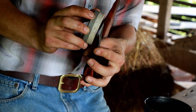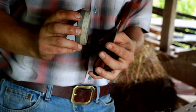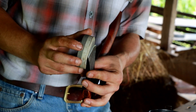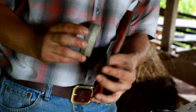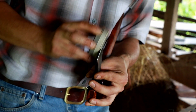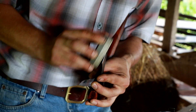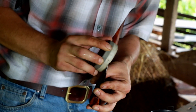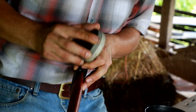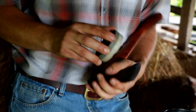What I try to do is stay with the original bevel of the axe. If you're doing a lot of heavy work like chopping up bone or a lot of hard knots, you might want to bring the angle in a little bit steeper to protect the edge. But for most things, try to stay with the original bevel. I usually just do it for a few seconds on this side, then flip the axe over and do a few seconds on the other side. When you get closer to the final sharpness, you would change sides more often.